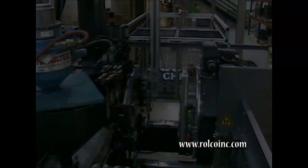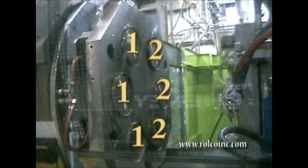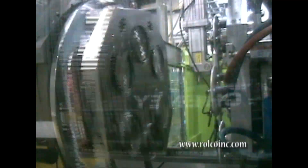The rotation that you see here is the action of a rotary platen mold. This type of mold has two sets of cavities that rotate and fill in sequence with two unique resins.